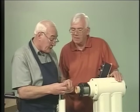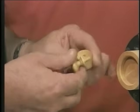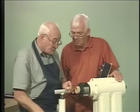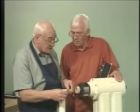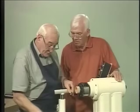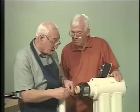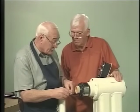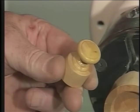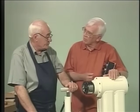What you'll see is that's a very fine 1/4 inch thread. The outside chaser did that, but we have no access with the internal chaser for there. So the way the problem was overcome, we drilled and tapped it with an engineer's tap, like that. That tap corresponds to my number 20 chaser. So when the threads all screw together, what we finish up with is a very nice, tiny little knob that's finished like that. It's screwed into whatever situation you want to place it. So we used a piece of boxwood there, which obviously takes a thread very well.